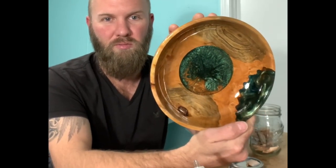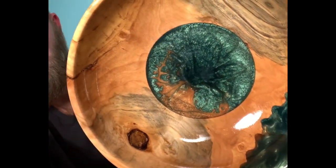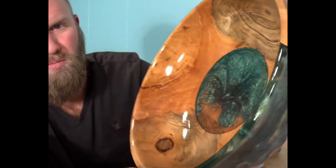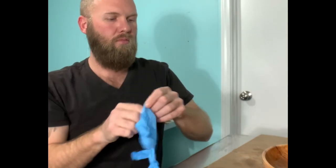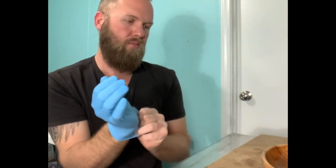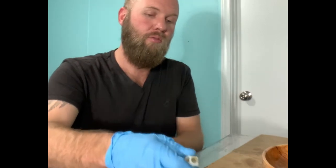The only way to get a better finish out of this is to sand it down and buff it — that's it. But look at the bottom — it's not perfectly round, but you don't see any streaks in it at all. No streaks — it's great. I love using it. It takes several coats but they claim it's food safe, so I'll stand on that versus lacquer in a bowl, which is not labeled food safe.